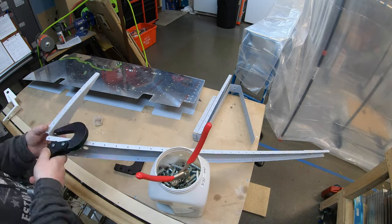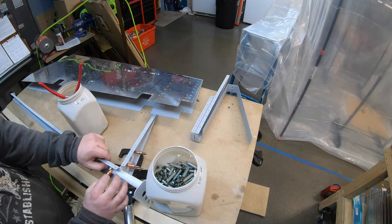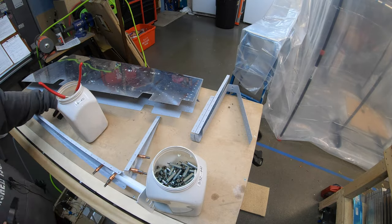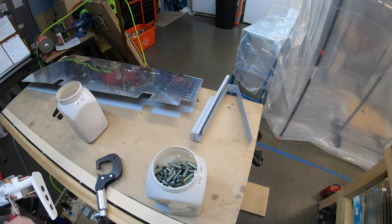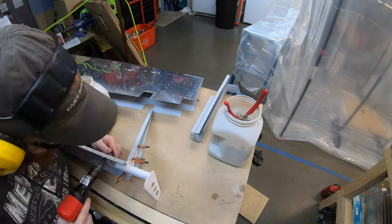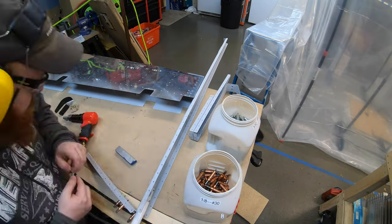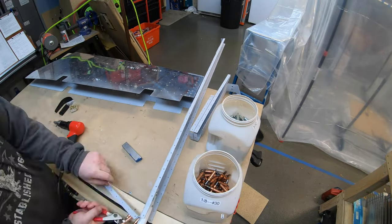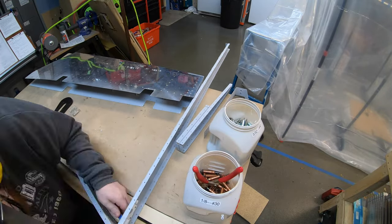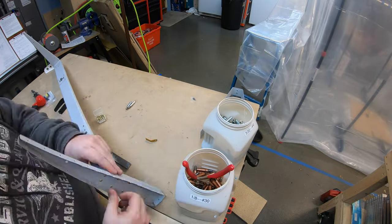Here I'm putting the weldment on. Initially I'm trying to use the squeezer just because it's obviously easier to squeeze rivets than buck them. Unfortunately, I just didn't really have the space, so I'm going to go ahead and buck these rivets. You'll see me pull out the rivet gun and just buck those 12 rivets. I think I squeezed maybe two or three of them before I decided it was going to be easier to just buck the rest. Since I had the bucking gun out, I just bucked the other end together as well - it's faster than getting the squeezer on some of those.